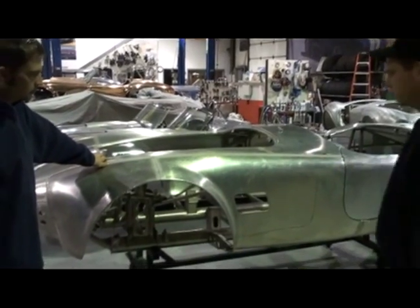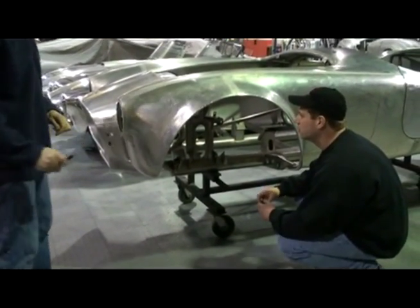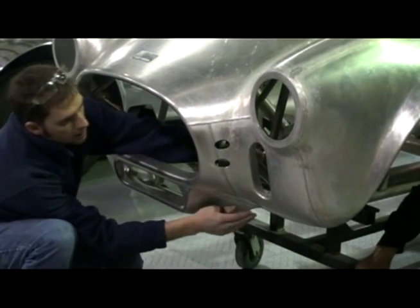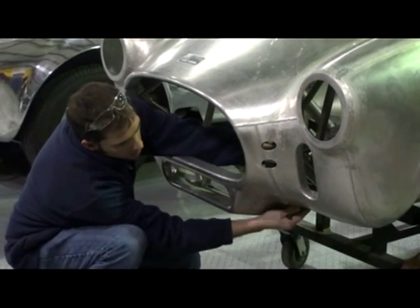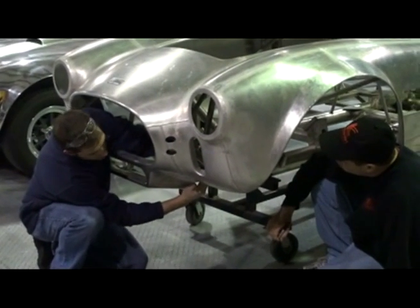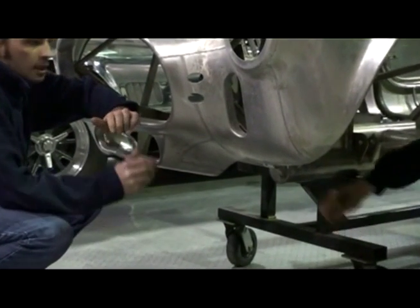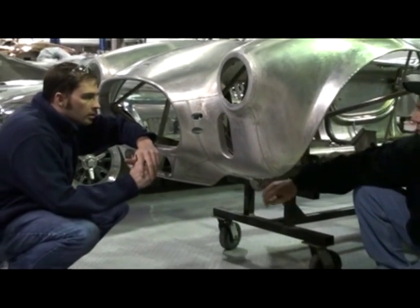We're going to need to cut it away from the chassis as well. We need to cut and add some hinges to the frame somewhere as low as we can, so that the nose tilts away from the tires and away from the frame. We're thinking we'll weld a hinge bracket about here where my hand is, and another one on the existing structure that's going to be cut away from where the sway bar mounts. That's a pretty solid tube there because that's where the jack hooks bolt in, so that should be a pretty good pivot point.